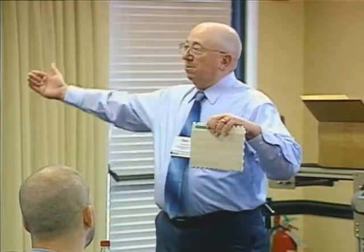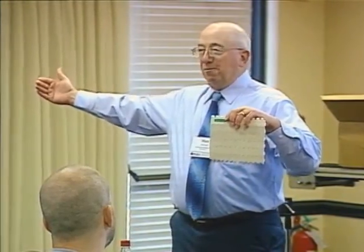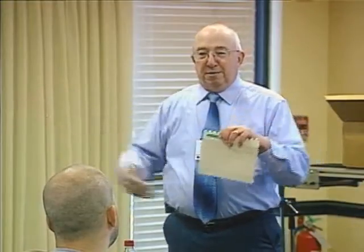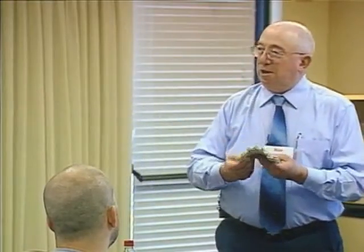If you want something different, they do what they call brick lay. A brick lay looks something like this. We've got 2 smaller modules put together with a bigger module, and you just continue to do that all the way out until you finish up with whatever length you want. You can build this out to very wide widths. If you want to go out to something like a 158-inch wide belt for whatever reason, you can do it with that.